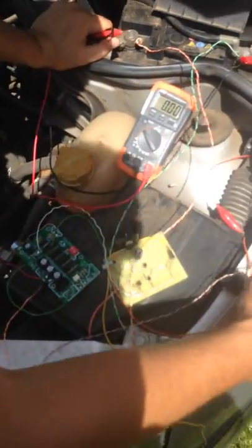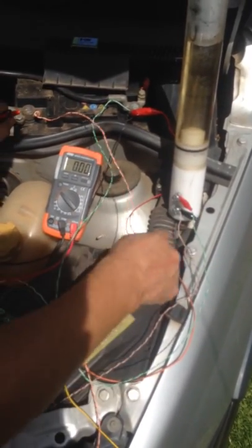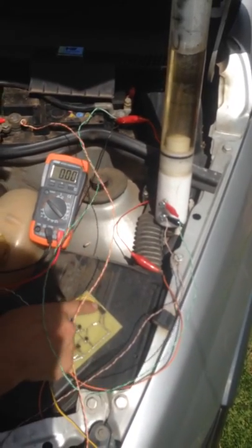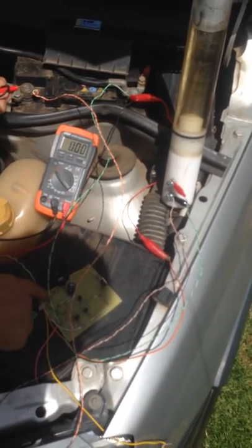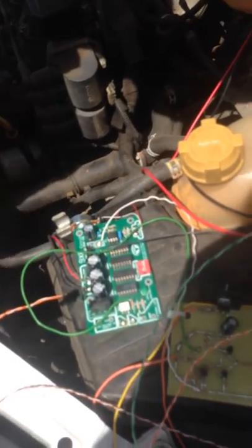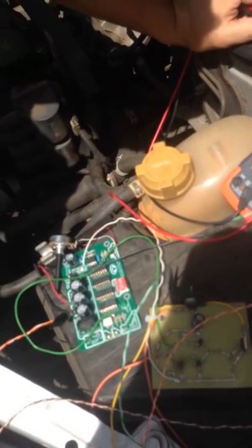Now, right here is going positive to the battery — this is the outer tube. The inner rod is going to the MOSFET. We have 12 volts from the battery, positive, going to the regulator. And we have common ground on the MOSFET going to the 9XB — common ground. What am I missing here? What is wrong?